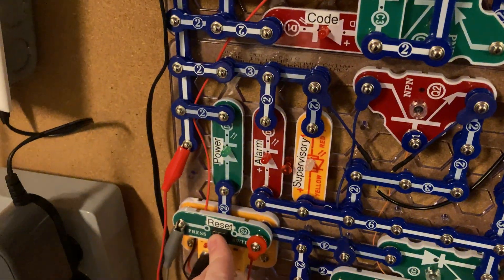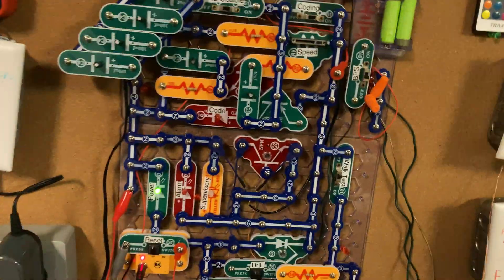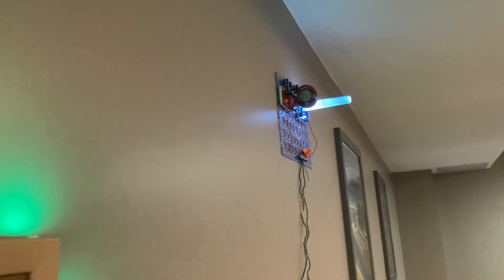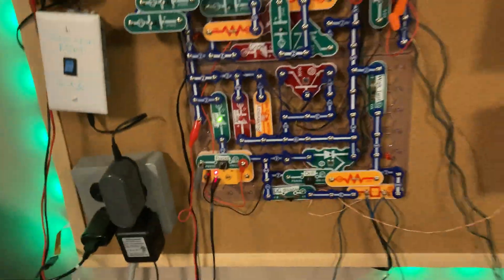I'll reset the panel. This SCR is stupid so it's not going to let me — as long as you just have to let the panel sit in the off state. Anyways, the horns will go back on. Everything's good. We'll do a walk test real quick and we'll do some manual code 3 on this guy here. Constant — that's all good, it's coded. Unfortunately these guys are lights, not strobes, so they do flash along to any coding — kind of like the good old 2903s.